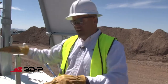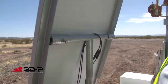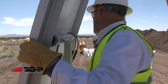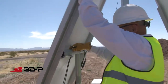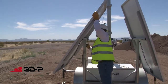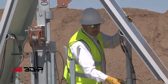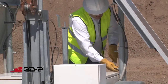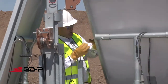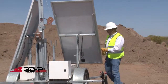To rotate the panels, we've got both rotate and tilt capability on these solar panels, again done with set screws. First, I'm going to adjust the tilt angle on this panel — we'll do a temporary set on the tilt and might adjust it further after getting them angled correctly. I rotate the panel to where I think it'll give a good 90 degrees to the sun, then tighten those set screws back up to hold that panel at that rotation. Next, we rotate the panel by loosening these two set screws here. Once they're loose, we rotate the panel to face south so that the shadow from the mast doesn't ever fall on the panel. Rotate that around and tighten the two set screws back up, then do the same thing on the other side.